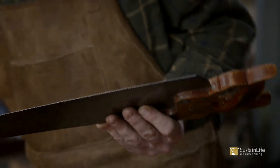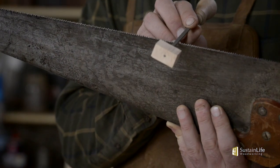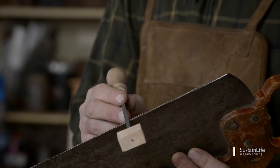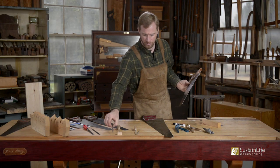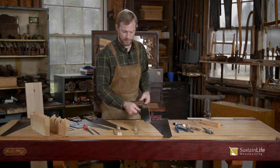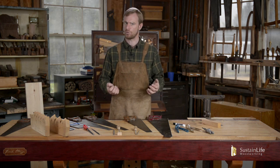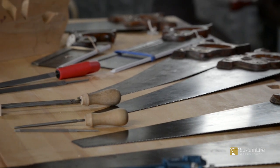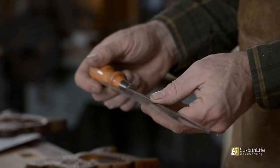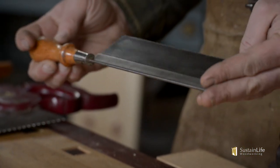This six-inch extra-slim might be a little large, so let's try the six-inch double extra-slim — that looks pretty close. For most saws, the six-inch slim taper and the six-inch double extra-slim taper will handle most of your sawing. The four-inch files come in when dealing with much smaller tooth patterns, such as a dovetail saw, which might have around 16 teeth per inch. A dovetail saw is typically sharpened for rip.